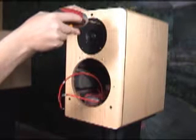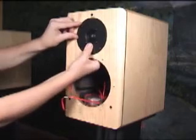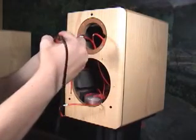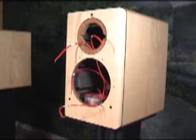Removing the tweeter can be more sticky, so stick your hand inside the cabinet and give a gentle push to the tweeter from behind. That sounded a little dirty. Be careful — you don't want to hurt the veneer. Next, just like with the woofer, desolder the wires from the tabs. Hey, Ninja! Your hand is in the way! You get the idea. Don't keep the soldering iron on the tabs too long, as you can damage the tweeter.